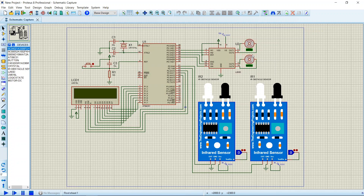The DC motors of the robot are connected to the controller using a motor driver IC, as the output of the controller is maximum 5 volts with very small current and cannot drive the motors directly. To amplify the voltage, the motor driver IC L293D is used. This IC can drive motors up to 36 volts and provide current of 600 milliamps.